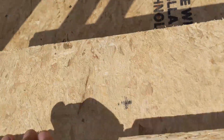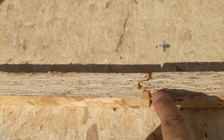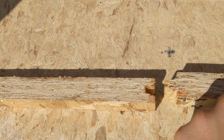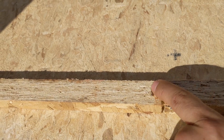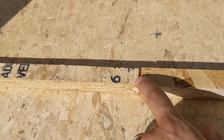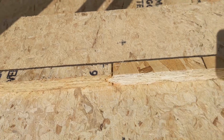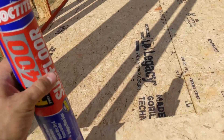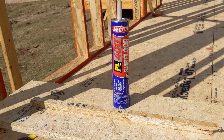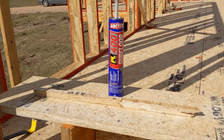The way that we do this quickly is the LP Legacy product actually gives us a tongue and groove profile. I glue it and put the tongue in the groove, and when my tongue and groove is set, I already have that gap installed and calibrated to the right thickness. So that is a very quick tutorial on how we did the raised floor from just a structural wood product standpoint.